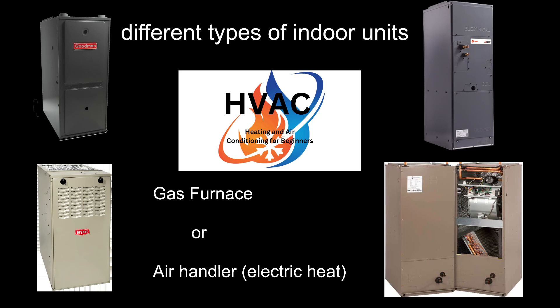On the right-hand side are your air handlers — the top one is made by Trane, and the bottom is a Ducane, which is well known on the West Coast. The Ducane gives you an open view of what it looks like inside: it has a tilted slab evaporator coil at the bottom, with the drain pan in the right-hand corner and your suction and liquid line sweat connections for copper line below. The blower assembly is a pull type, not push, and above that is your electric heat assembly and control devices, with the circuit board below.